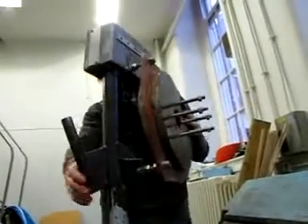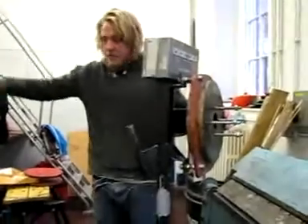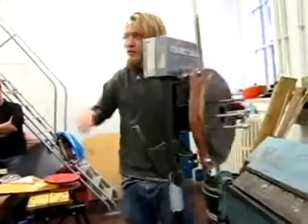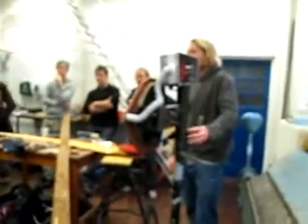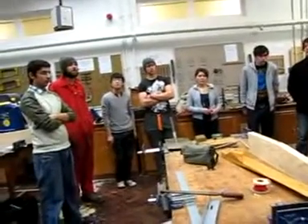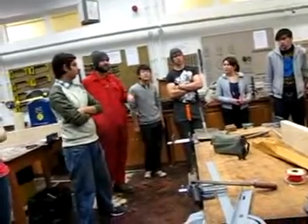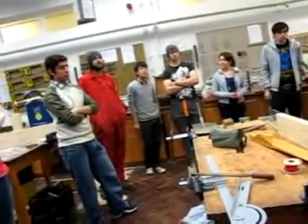There's a tail at the back that sits on top and faces out, so as the wind changes direction, the tail orients it. A few subtle things have changed in the latest design — a slightly different mounting and stator, with one fewer coil, and everything's a bit beefier. That's just from feedback of people's turbines, adding an extra few millimetres into the dimensions.